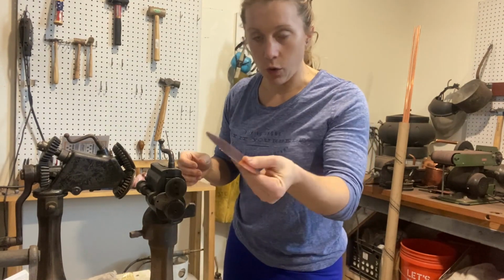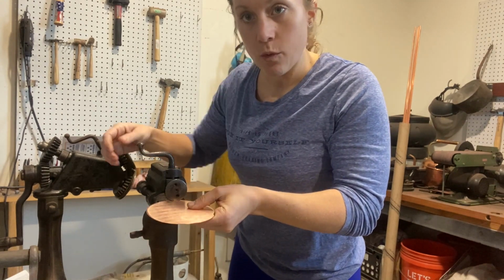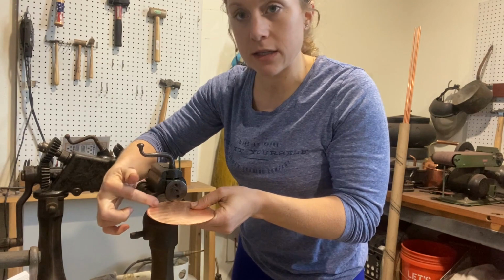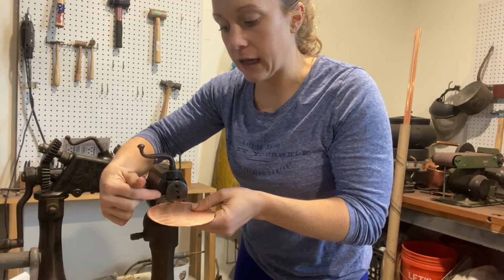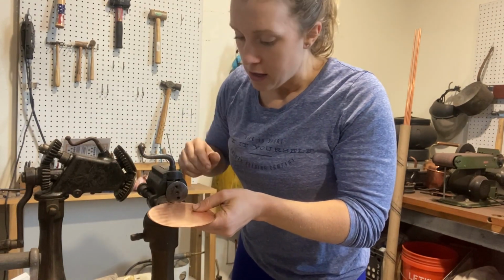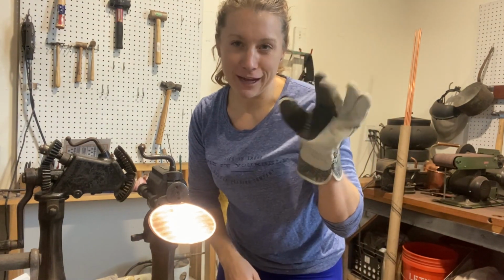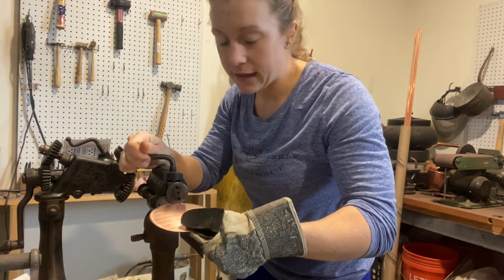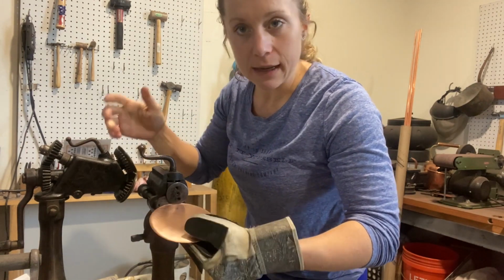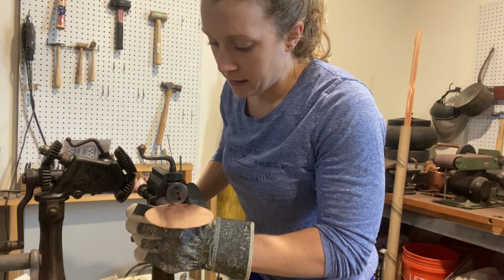Now, you can do the burr itself a number of ways. You can hold it like this, and you're not gonna go down super far, and you can guide it this way. What you're gonna wanna do is constantly be pushing this part into the backstop. The rest of it will feed through. So you're looking against the backstop, not where it's coming out. But I learned from Bob to just take a garden glove and add a bunch of extra leather, because otherwise you'll cut your hand. And you don't need to crank all the way on this, okay? So you actually are just getting it so it holds it in place like this. Then,